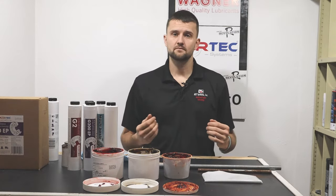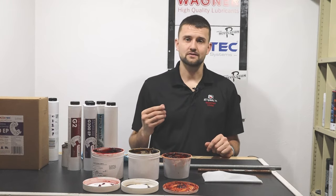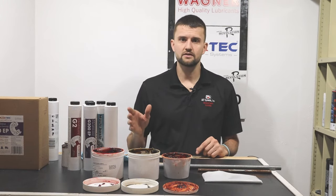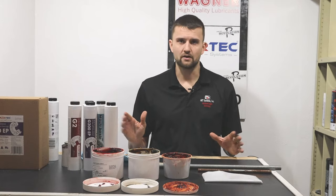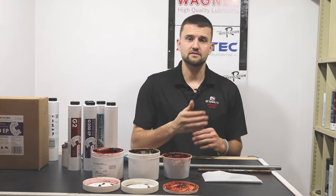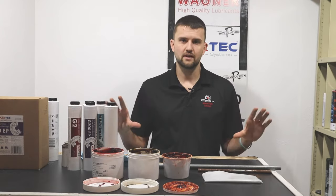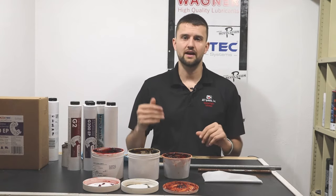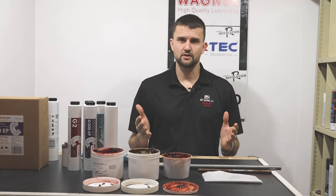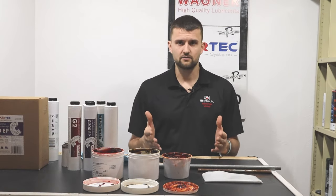Now let's get to tackiness. Tackiness is something that a lot of companies push grease on, and what I really want to make you aware of is that greases and lubricants are like any other product — whether it's beer, bubble gum, t-shirts, or shoes, companies are looking for a marketing point. It's important to realize that there are different aspects of grease that companies are highlighting to market it to you. You need to take a common sense approach and say, 'All I need is a lithium NLGI 2 rated for 375,' and find that grease.